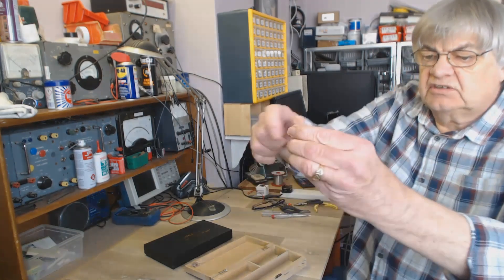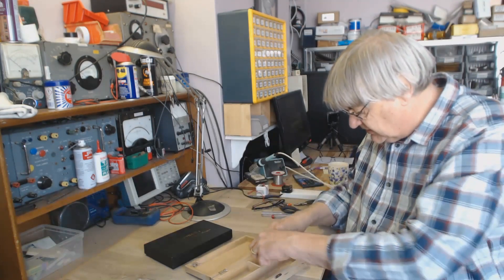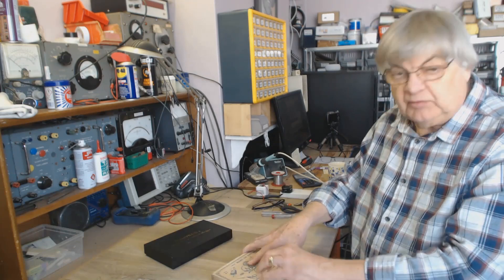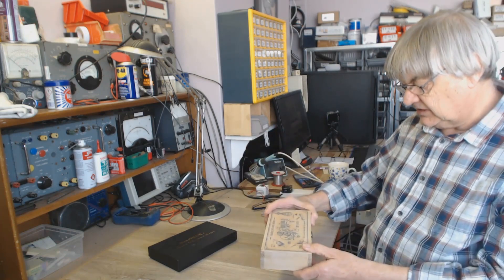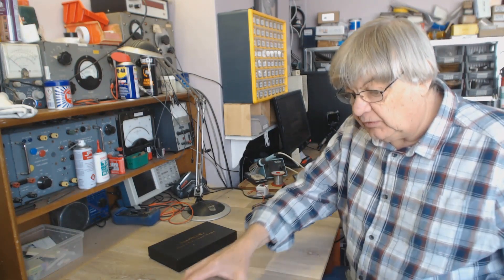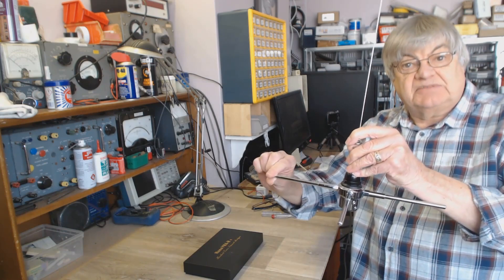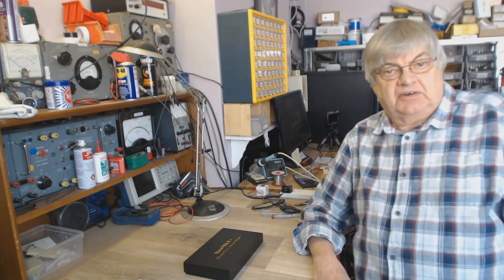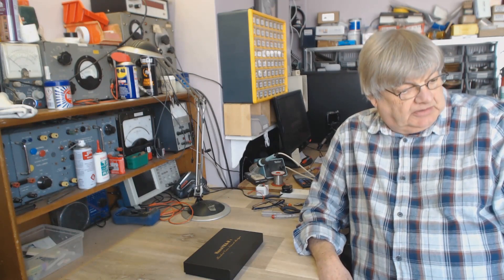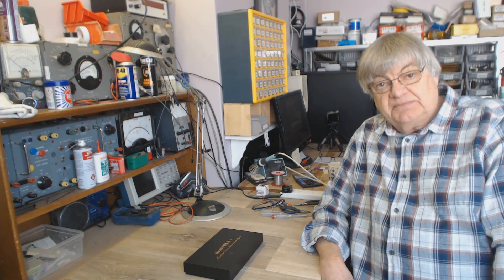I bought some extra adapters and things — various SO-239 adapters — you get one with the device but I bought more and found a box to keep them in. I hope that's helped. This aerial — these radials are about a quarter wave on 70 centimeters, so the main element is obviously something bigger, but it is a 70 centimeter aerial. I'll probably put it back out in the garden on the pole as a spare. Okay, thanks for watching as always — I'll see you next time, bye bye for now.